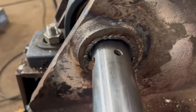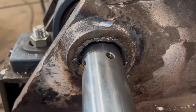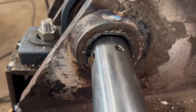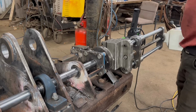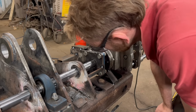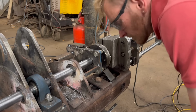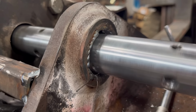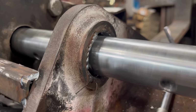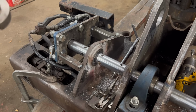But these little holes are difficult. It's a 40mm bar and it's a 50mm hole that I'm trying to line bar through. When you see other people line barring on YouTube, they're doing real big bars. They look nice and easy, but these little ones are bloody hard work. Right, so I've got one final cut to do. I need the tool moving out 0.9 of a millimetre.